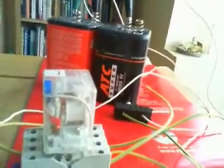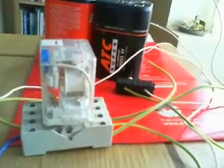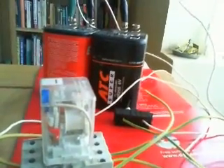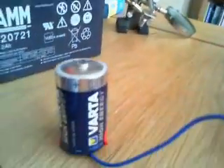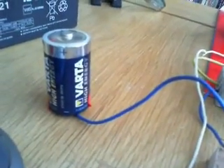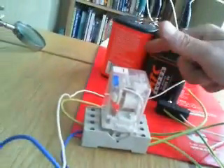In order to be able to switch that, I've set up a little mechanical oscillator — it's just a household relay meant to drive 240 volts from a 12-volt relay coil. I've got two 6-volt batteries in series to give 12 volts to power the relay coil. And then this little D-cell is what's actually going to power the transformer. The D-cell is 1.5 volts and it's completely isolated from the other two. Essentially the two batteries are just switching the relay coil, and that switching allows this 1.5-volt battery to be switched through the transformer.